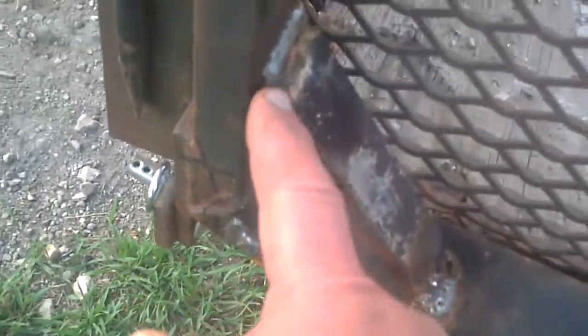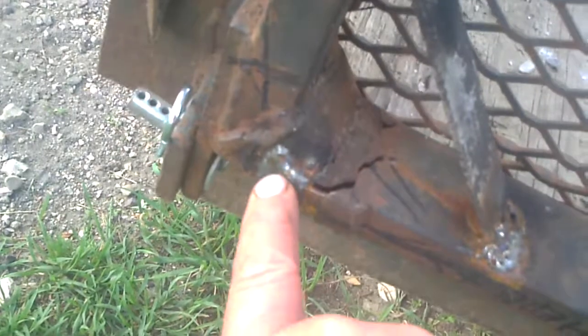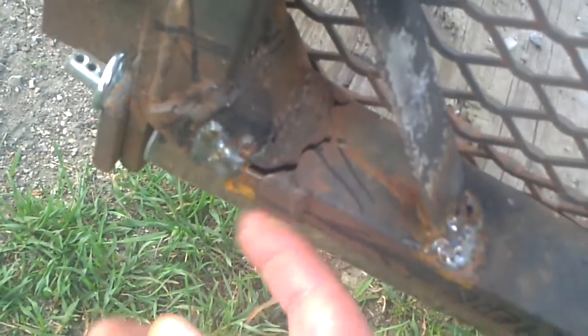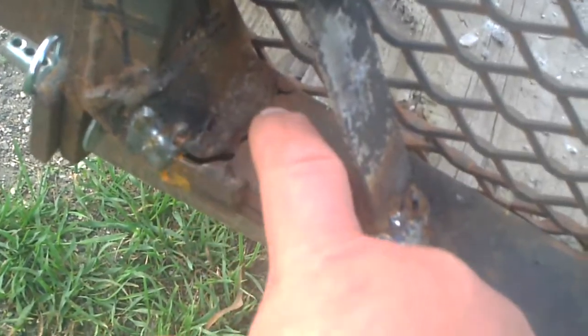The gate of the trailer I took into work last week — the metal shop teacher reinforced it. It was cracked on this side and he welded a steel plate on the crack, and this corner was loose so he reattached this angle bracket. He didn't do the best job but at least it holds — he welded the bottom but not the top, probably forgot, but that's all right.